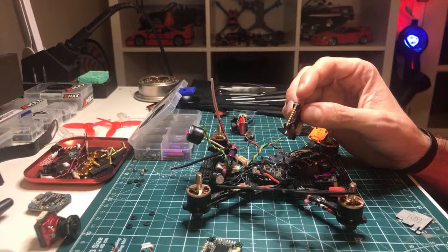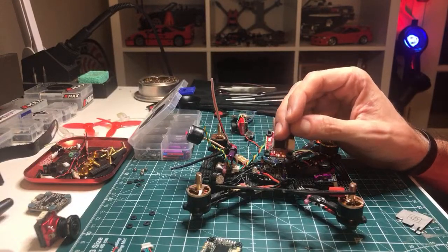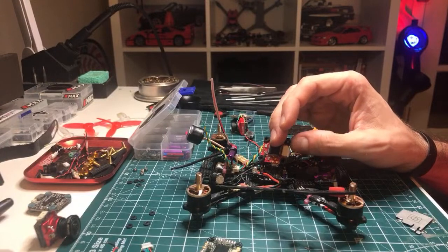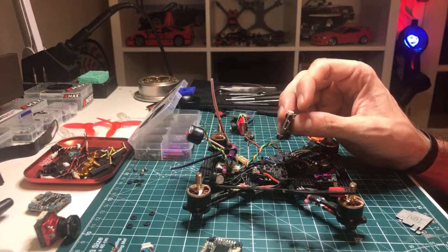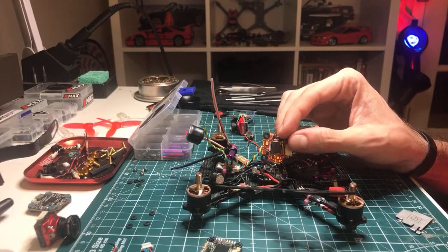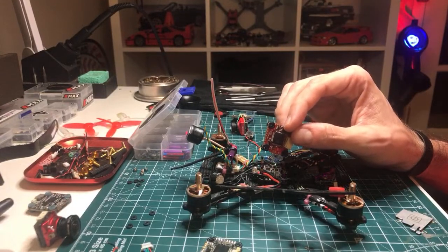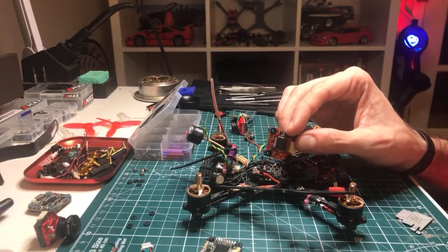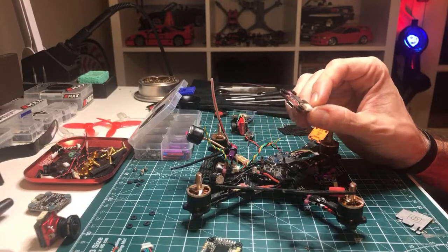Another 3-inch micro rig, just so that we have some kind of data on where the vibes are happening on micro rigs with much higher, you know, double, almost triple the RPM, even on a 2.5-inch prop, on the 2-inch prop, and the 1.9s and the tiny whoop props. I mean, they're spinning like 4 times RPM. So that really shifts where a lot of the vibes happen, and that's the kind of thing that you can only really see in black box.